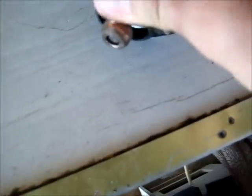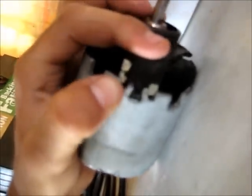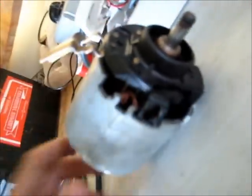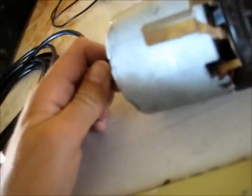That's actually supposed to go there. I'll try and get this thing back together, see what happens. Okay, that's what the damn thing's supposed to look like. I'd have put something to hold those brushes in with a spring. Somehow I'll center this plastic bit and just tape it up to insulate everything. This won't even hold center because of the power of the magnets, so it might be a bit hard to get this thing to center, because the other clips have been smashed off. Something like that where those clips would have been. Hold this thing center, put some sort of springs in those brushes and a non-conductive band or zip tie around it to hold it together and center it, and it'll be fixed.